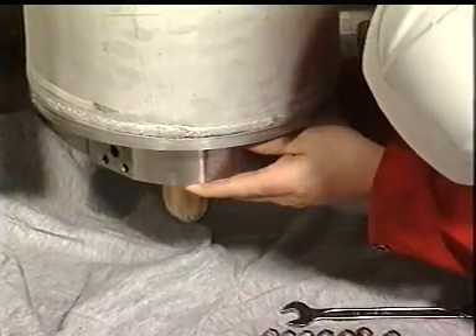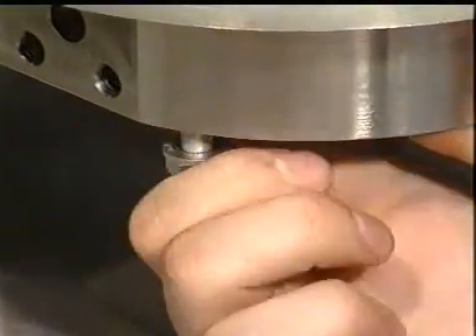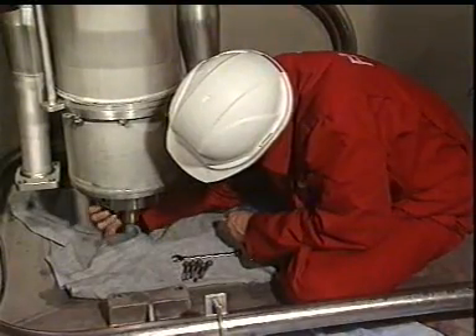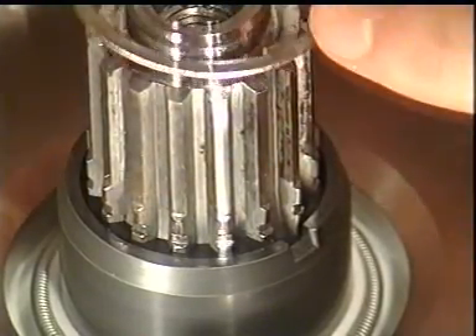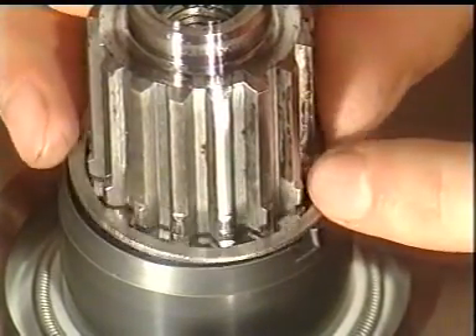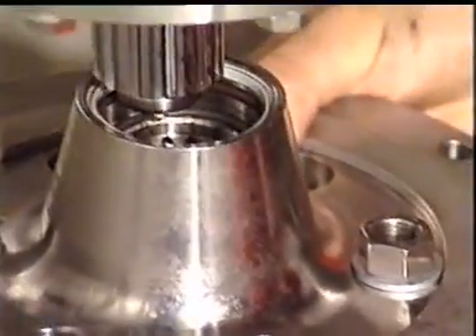Never install a damaged O-ring and be sure of no corrosion, cracks, or dirt. Remember, use only genuine spare parts. Also pay attention to how to fit the retainer ring in the right position — at the end of the ceramic sleeve and in position on the splined shaft.